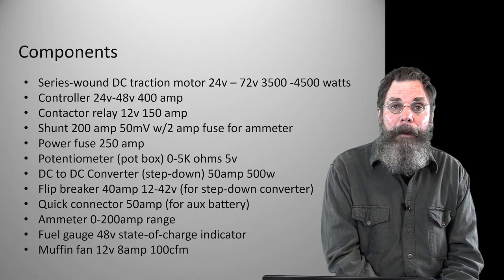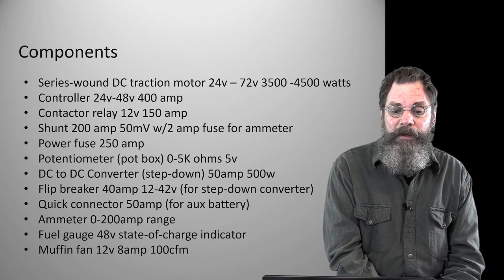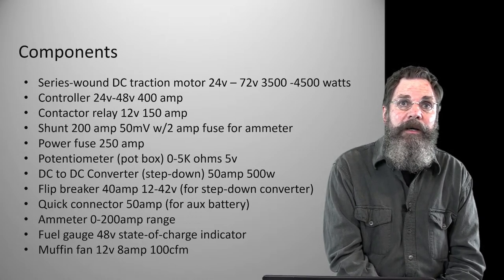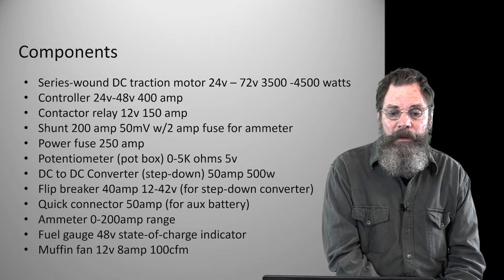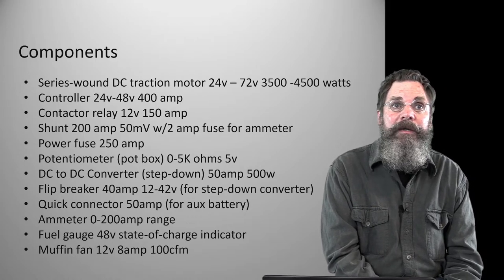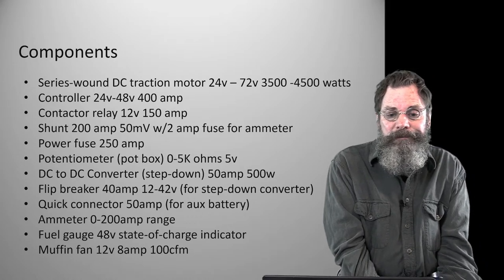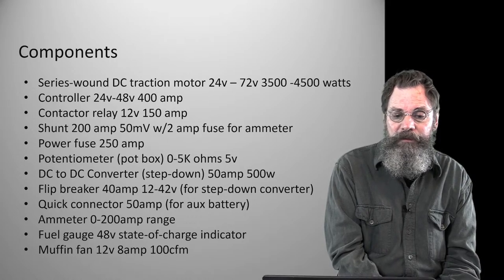It's basically in the circuit that charges, that operates the step down converter, so that if anything happened with that circuit, it really needs to be fused. I don't want it to burn up the converter, so I'm not replacing expensive parts, it just flips off, and then you flip it back on. There's a reset button and a testing button for it. So these things run, I don't know what it costs, like $16 or something. So that was a nice little addition.